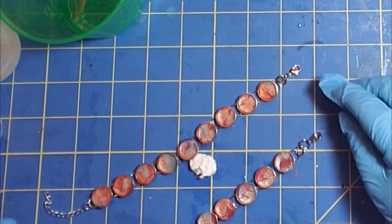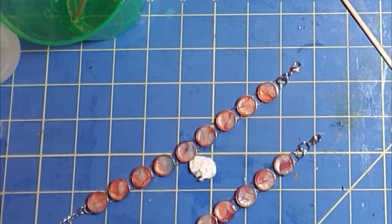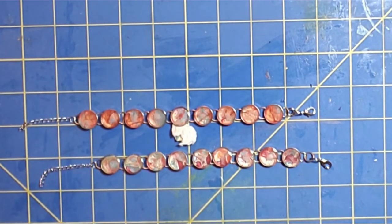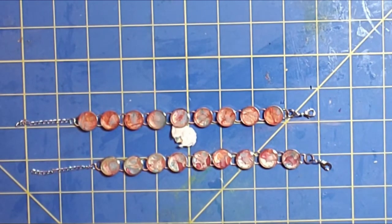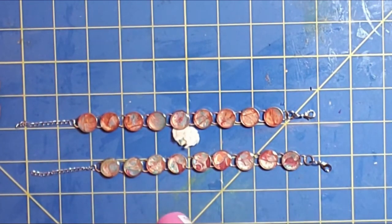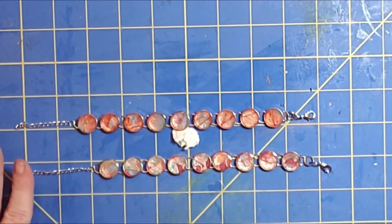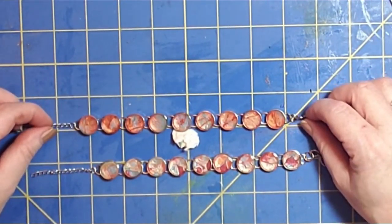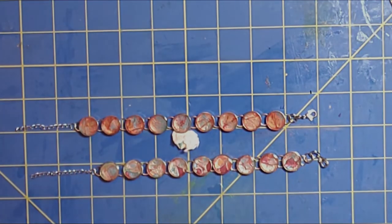Those will dry for the next 48 hours and then we will be all finished — I will pop back on here and show you the finished work. Sometimes you do get a few bubbles, and just so everybody knows how to do this, I'm going to use the heat gun. Literally all you have to do is just barely hit it and they pop right out — you have a clear finish. That few seconds with the heat gun and all of those bubbles popped. Very simple and easy to do. Now these are ready to sit here and cure — I've got them in a spot where they won't be disturbed and I will show you the finished product when it's completely dry.